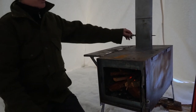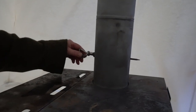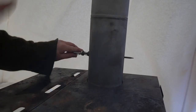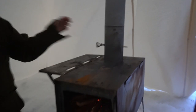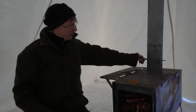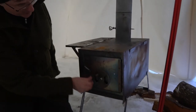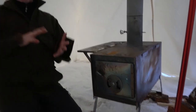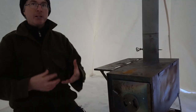Now this is your damper - you want it up, so don't close it, because then you don't have oxygen coming up or smoke shooting up. Open it right up. Throughout the night, if you want to let it burn a little bit slower to keep the heat in, you can close the damper a bit - that will help. If you want to do an all-nighter, get some good oak in there, close it a bit, and a little oxygen goes in but not much, so it burns a lot longer.